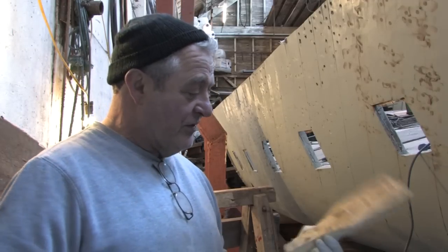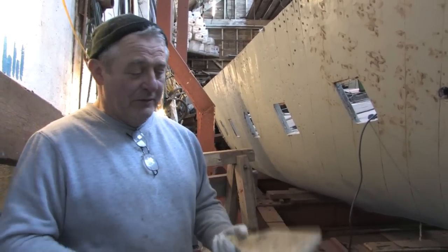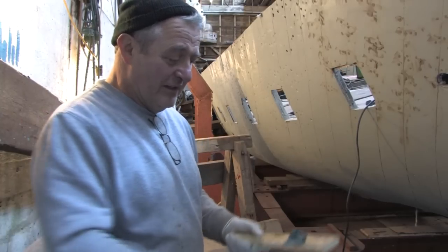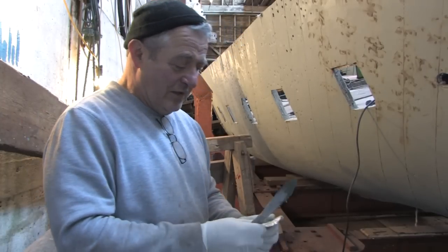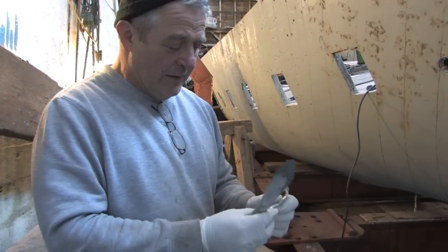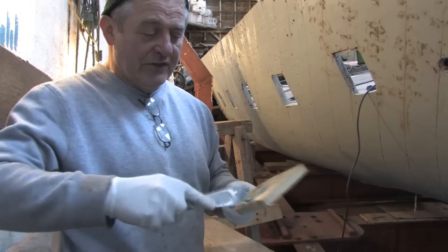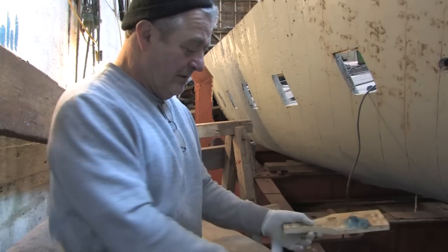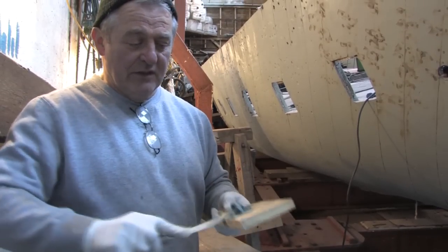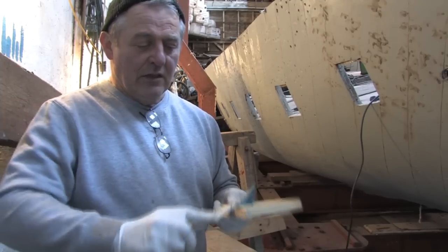The easiest way is to just cut a piece of wood like an old fashioned butter bat so you can get a good hold, finger under the bottom for a bit of support. I'm just going to mix a very small bit because we're going to be fighting the tide. Another trick of the trade is never mix too much because with it being a two pack, if it starts to go off before you're finished using it, it goes in the bin, you can't use it. So you just do a very small bit. Always try to keep your lid on as long as possible because the vapours start to dry out of the product and it makes it drier and harder to put on.